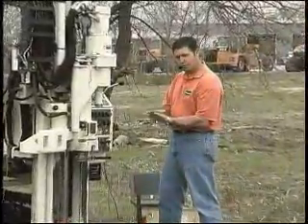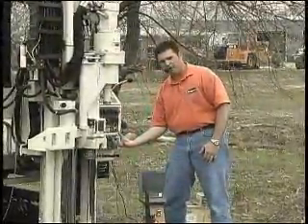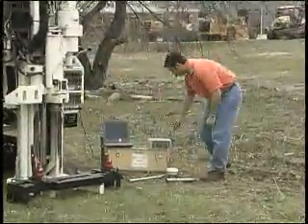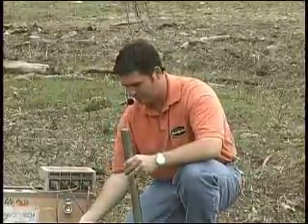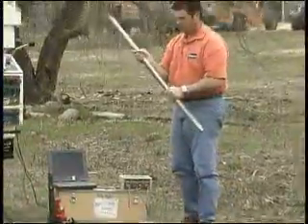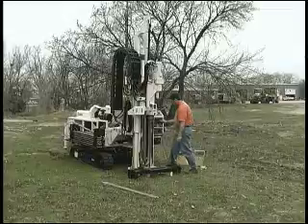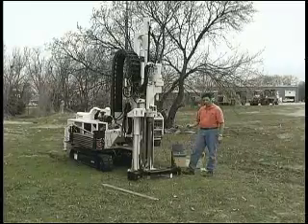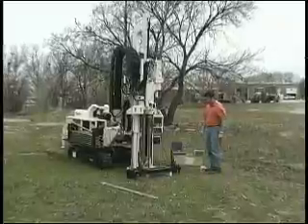When I apply pressure and start pushing on top of the cone, I'm going to push up against the bottom surface, and in turn the top of the microphone is going to push up against the hex drive of the GH60 hammer. This cord is attached to the interface. Now I'm going to install my porous ring and my tip. The next step is to connect the system. If I did have an open pre-probe hole here, I can enter a pre-drill into the software and lower the cone into the soil and begin pushing from there. I'm going to start at the surface with no pre-drill.